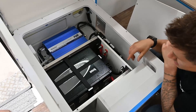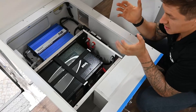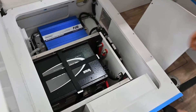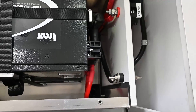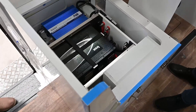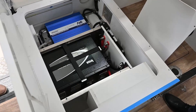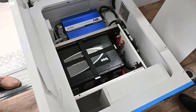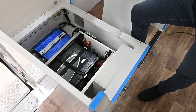To touch on the box a little bit more — when we put this together, we fully silicon it off. On these videos you may see at a lot of the points where you've got rivets or inserts for fixing together, it's actually siliconed in. Down in the bottom corner you'll see there's a hose that runs through the floor — that hose is venting the box to the external of the trailer, through the floor. Very similar to the way we do our gas compartment boxes on particular models where the gas bottles sit inside and we vent externally, which is a legal requirement — same thing here.